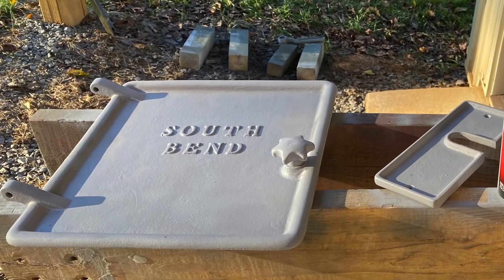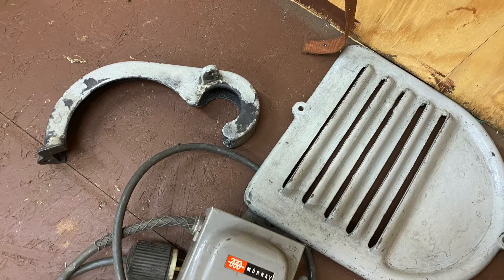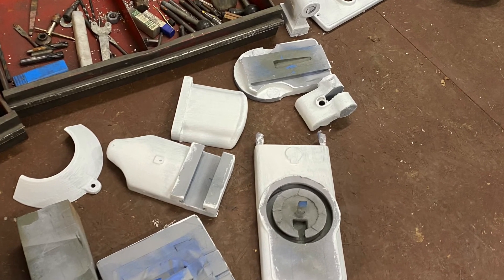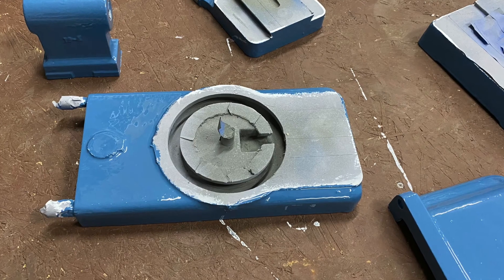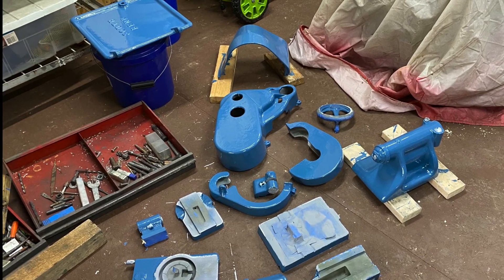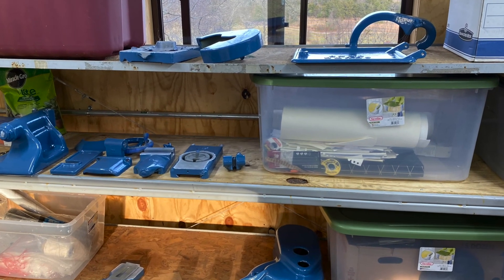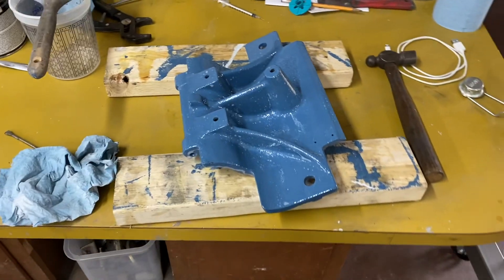I just love working with these old cast iron parts from the South Bend lathe. They're just all solid — they've got brass tags. There's a real solidity to them. So I've got the old paint off, and I've shown a lot of that before: putting on Bondo, sanding it off, trying to get them smooth. Got some paint on them and it's starting to look nice and glossy. But I'm concerned that the gloss from that high-gloss enamel is not going to last if it gets scratched, so I'm going to use a two-part clear coat which you have to mix together, and then it hardens to put an outer shell on it.